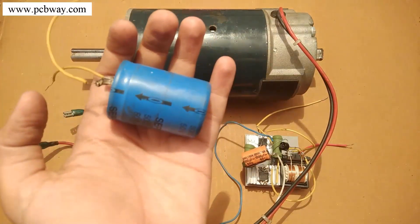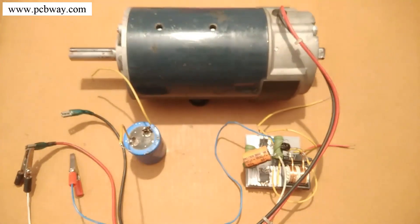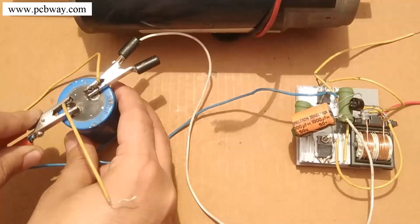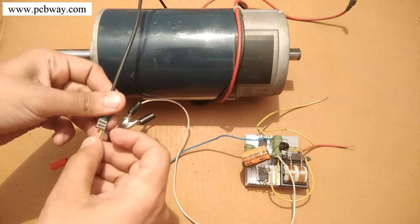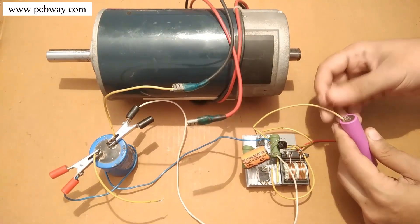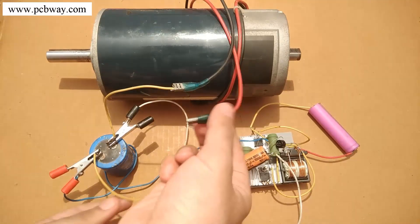I have made the circuit four times more efficient just by changing the value of the capacitor at the output. I'm going to use a 5000-microfarad capacitor rated at 50 volts DC. The negative terminal connects to the black crocodile clip from the circuit, and the positive to the other clip. This capacitor enhances the power output four times. The previously connected 1000-microfarad 50-volt capacitor remains, making the total output capacitance 6000 microfarads at 50 volts DC.